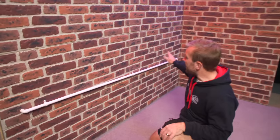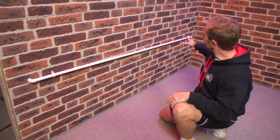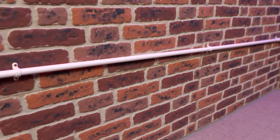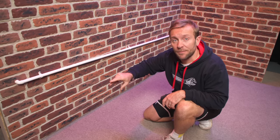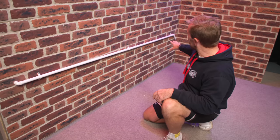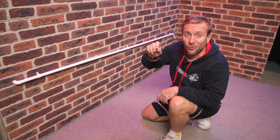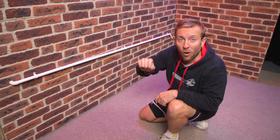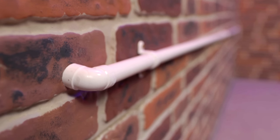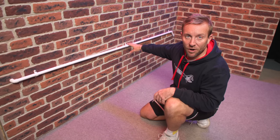So we've got a condense pipe here along this lovely, incredibly realistic brick wall. The condense is gonna come out here and then run down. A lot of houses in the UK, or anywhere with a condensing boiler, will have a pipe like this outside. The problem is the fall isn't quite good enough - water only trickles through at like one drip every 10 seconds, which means water takes a long time to travel along the pipe. In freezing conditions, that means the pipe is very vulnerable.